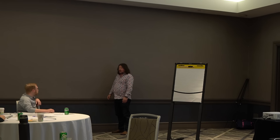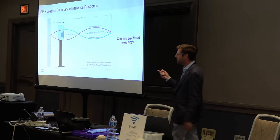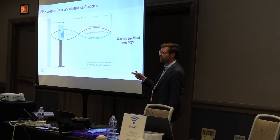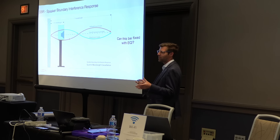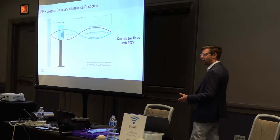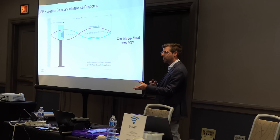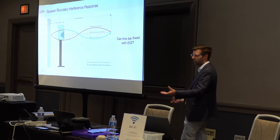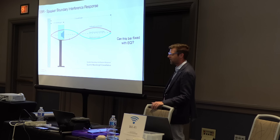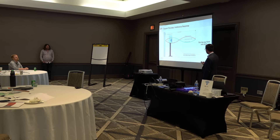Or in-wall, or build a really good baffle wall — though baffle wall design is quite a long course. I'll also mention there's a white paper on this published online. Some of the monster high-output subwoofers are about a meter and a half deep. Those will have exactly that problem. I had one of these subwoofers to review, shoved it up against the wall in a corner, and had a cancellation dip around 70 Hz. I couldn't figure out what was going on until I turned it sideways and it went away — this was an SBIR artifact. The subwoofer was so deep it was getting this SBIR cancellation right in its operating range, making it kind of useless.